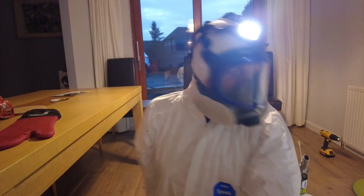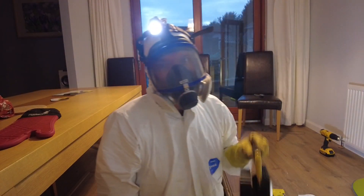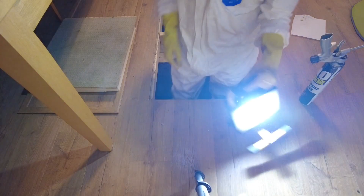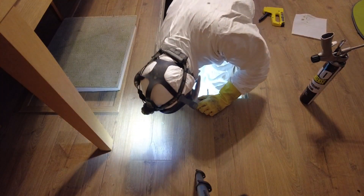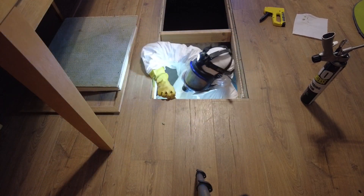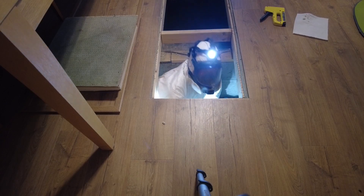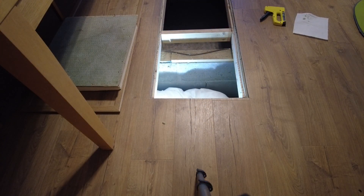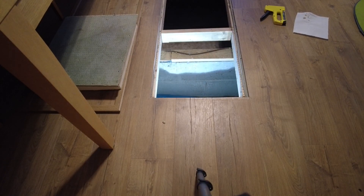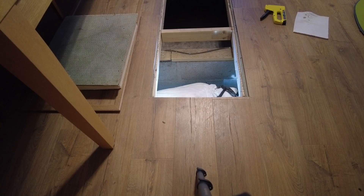Time to go underneath the floor with this and my handy lantern. I'm absolutely confident there's no Covid under my floorboards, but there is a lot of dust. When handling rockwool down here, bits tend to fall right onto your face, so a full face mask — as opposed to a half mask and goggles — is absolutely essential to stop any irritation getting into your eyes, as I found when I fitted the rockwool three years ago.